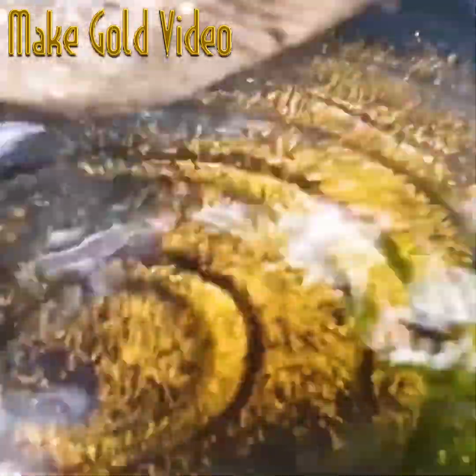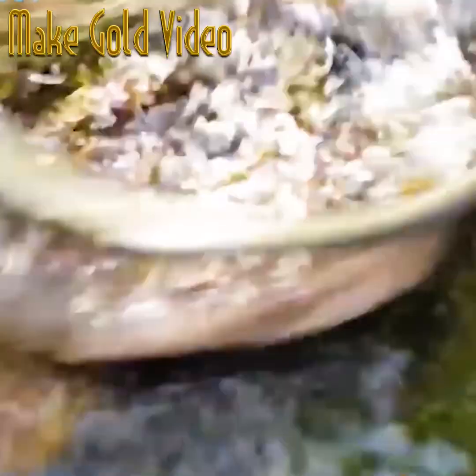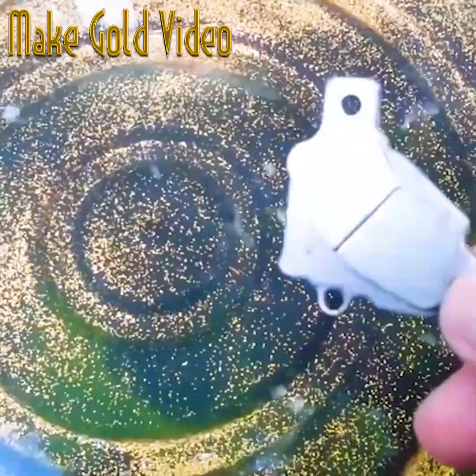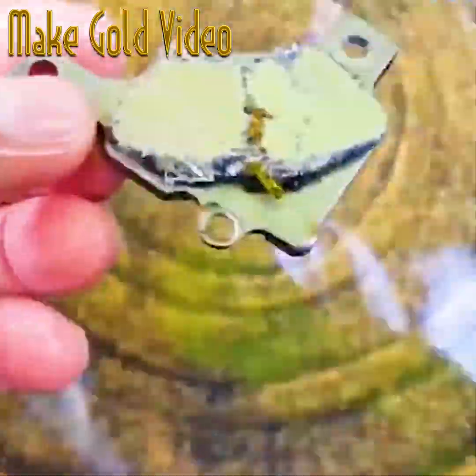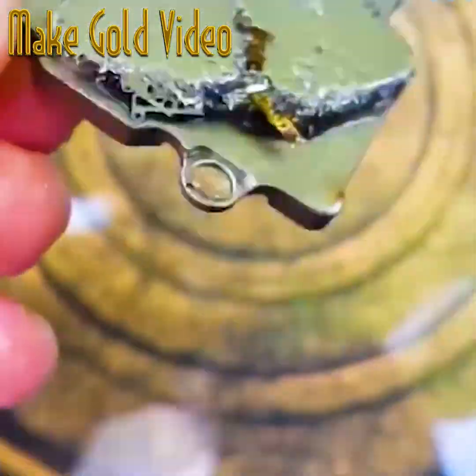The connection points are soaked in a 68% nitric acid solution — five liters of it mixed with five liters of water. It's then run through a colander, making sure to only let the gold dust and gold particles through, to remove any remaining scrap metal that are considered impurities — in this case, a magnet from the hard drive itself.